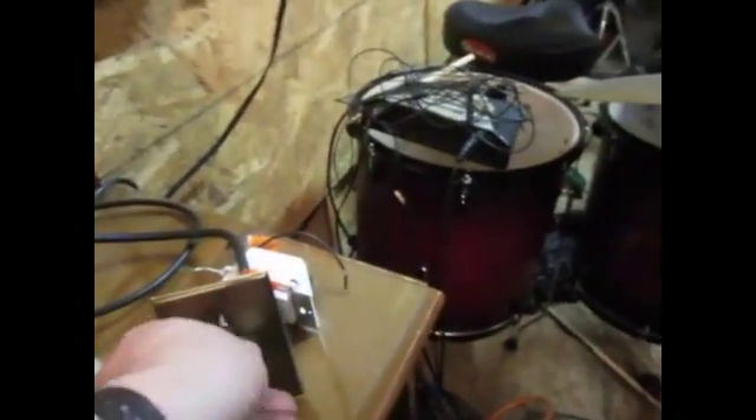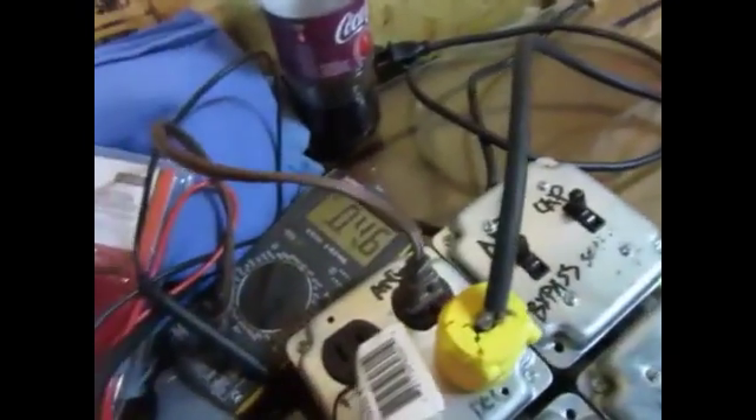I'm at 0.33A and it's rated for 0.45A. It's starting to go pretty fast, but it's nowhere close to high. I think this FASCO here is definitely a winner. Now let's just do high — it's got to drop back down to 0.45A. Yep, that's high.